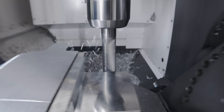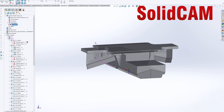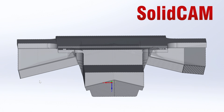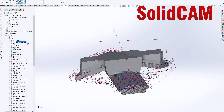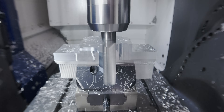Now let's get into this last operation. I tried to get the bulk of the material off earlier so I don't have a lot to contend with on this second side. One thing to watch for is that the Chevy emblem is getting a little thin out on the edges, and I didn't want to come up with a complex fixture to support that. So we're going to keep that in mind while roughing — after this first pass I only cut the outsides and didn't come into the inside much. While the material is thick I want to use that to my advantage and work from the outside in.